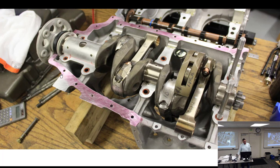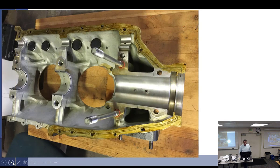When you put these engines together, note that the mating surfaces are a highly machined parting flange — it's supposed to be oil-sealed. You have to put it together with something. For Lycoming, we're going to use Plyobond number four and silk thread. I use a double silk thread. The directions say to make sure the silk thread goes on both sides of the bolt holes — meaning this side and this side, running a continuous thread around.